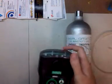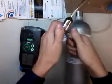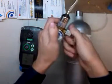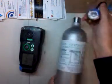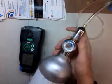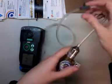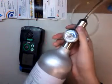The monitor is fairly simple — you can hear the pump running in the back. To attach the cylinder, first unscrew the regulator so it's open. Take your regulator and screw it into the cylinder. This only applies if you're using a regulator like mine that has an outflow port. Most likely, if you're calibrating this unit, you'll already have a demand flow regulator with you.